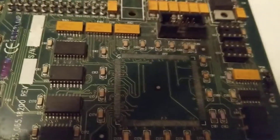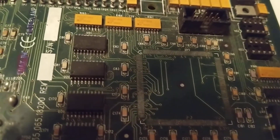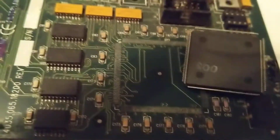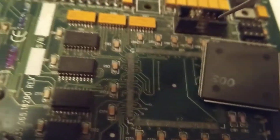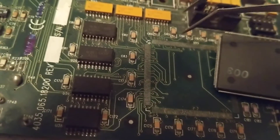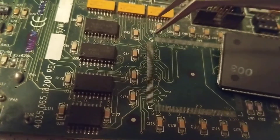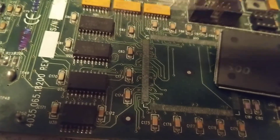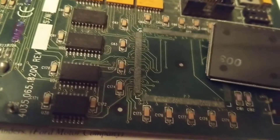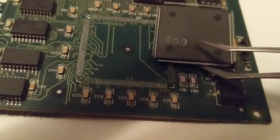Let's look at the chip — this is not the exact size, but I think you'll understand what I'm referring to. These are all scrap boards, by the way. They have broken lands and therefore cannot be repaired. I'm not grounded right now — this is not a ground mat — but when you work on technology like this you have to ground yourself, ground the board on a ground mat on the bench. Otherwise these chips will be destroyed. They have something called MOSFET technology — transistors that cannot take static discharge.